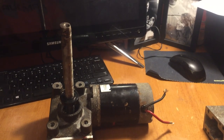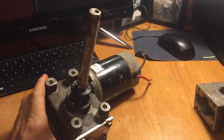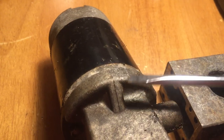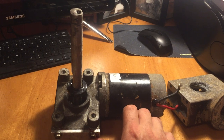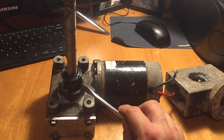I don't know if it's worth it when you could just spend $60. If you buy my kit, you're going to get four bearings and a woodruff key for the shaft. Your four bearings are going to go right here, right here, one in here, and one where the motor connects. If your transmission motor unit seems like it's lost a lot of power, or most likely the shaft won't turn at all, that's because your bearings are locked up inside. Salt has gotten past the seal over the years and locked everything up.